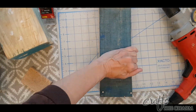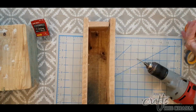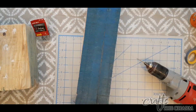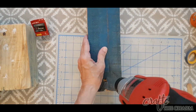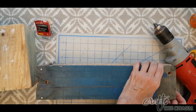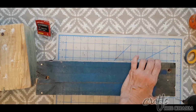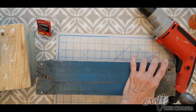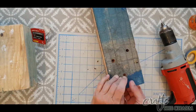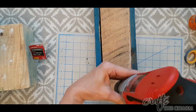Now the 1-inch nails really turned out not to be long enough, so I went and got 1 1/4 and 1 1/2 inch, and I ended up using the 1 1/4. They were long enough. And I really can't nail on this little table. It's just a little card table. So you're not seeing me nail these in completely. I'm just getting them nailed in enough that it's into the lower piece of wood, and then I'm taking them down to a hard surface and finishing the nailing in.